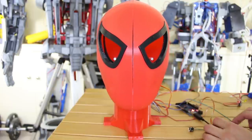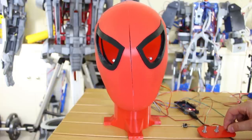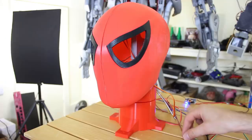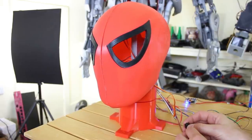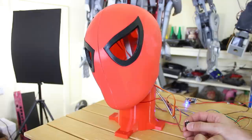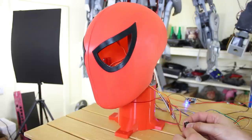I've actually built a mixer in, so I'm using one of those knobs to go up and down which moves both servos. Then the other one that moves it sideways takes the centre point value, subtracts it from one servo, and adds it to the other to give the tilt. And of course the button still makes the eyes blink. So we can do sorts of things where we look at somebody and give it all sorts of characteristics that make it quite human-like.